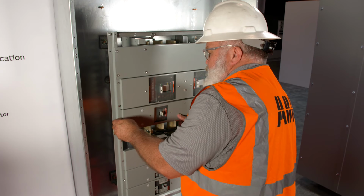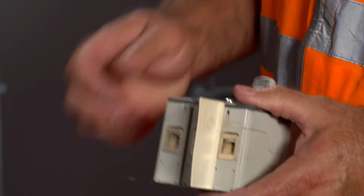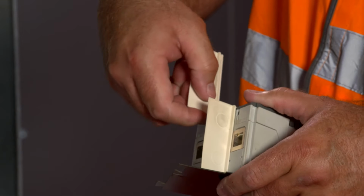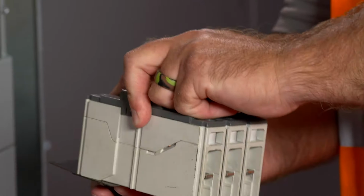First, prepare your breakers. Install appropriate lugs on the load side. Use both phase barriers on the line side, plus an additional phase barrier when breakers are installed in adjacent rows within the panel. Be sure to use the insulating plate while mounting the breaker on the panel.